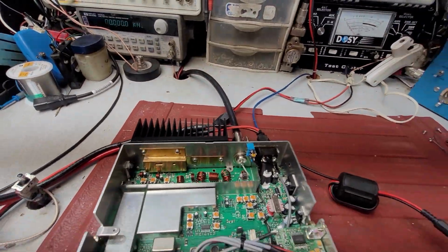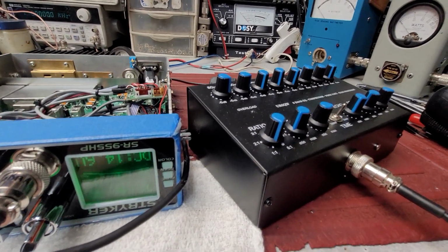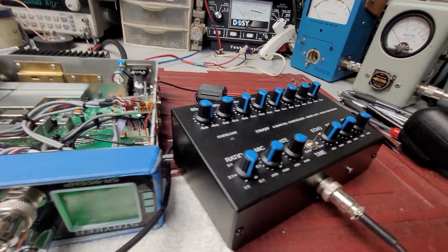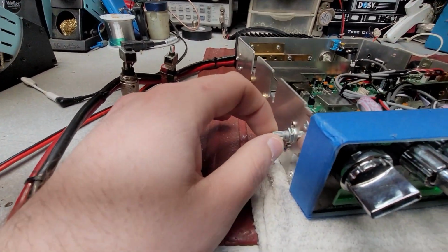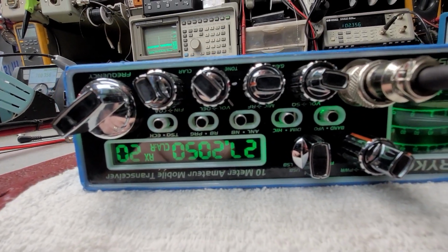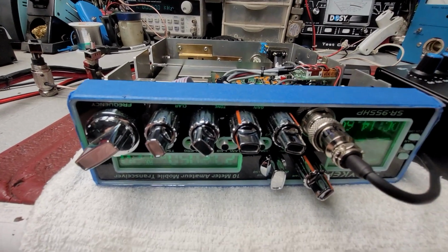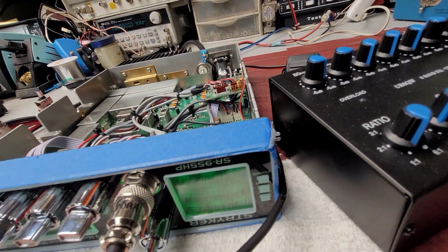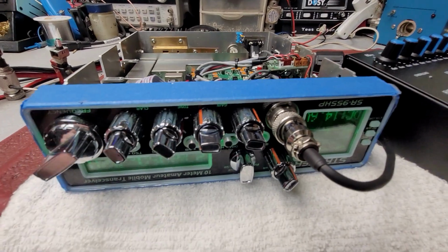But my circuit, with my selectable bass, I can actually customize to multiple different style microphones. You can run whatever you want to run on here without having to re-EQ everything to run that specific microphone. I've got a variable treble on this radio here. We've got an upgraded echo board that's done out the face, made a little mark on it for him. We've got a Hifi transmit, Hifi receive, upgraded filter, upgraded finals, variable peak control so you can control his peak output, and then the selectable bass, and the EQ, and it's D104 and all that stuff too.